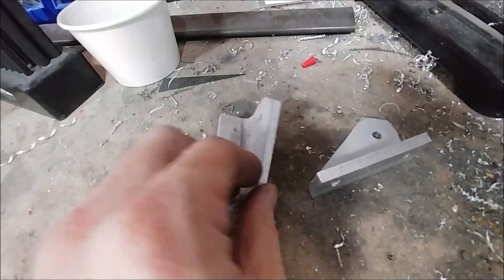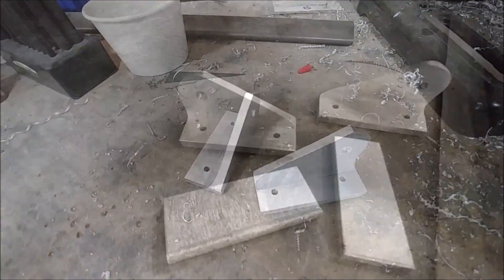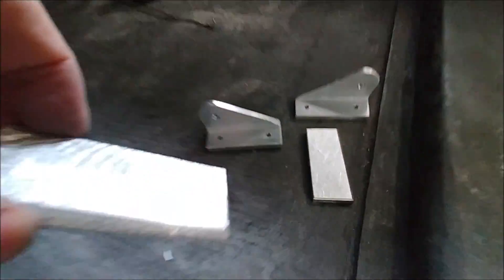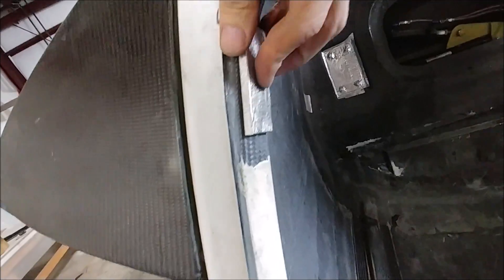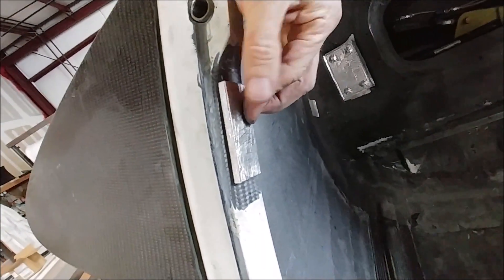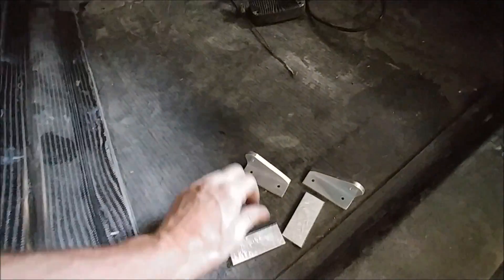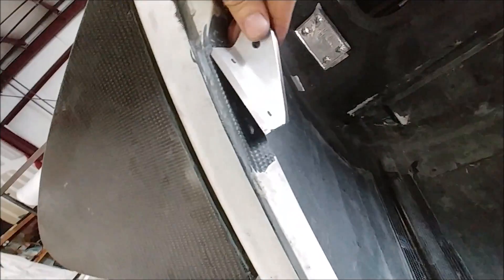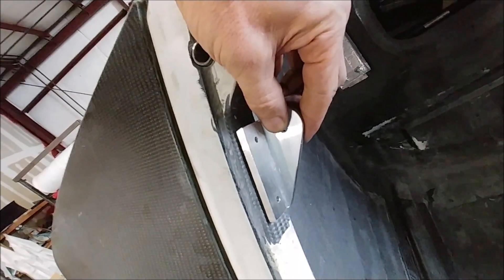While that was happening, I took the time to make the brackets and hard points that actually mount on the door frame of the fuselage for those gas struts. There are the hard points, all roughed up — that's pretty much where they're going to bond on the aft side of the frame. The brackets are done as well and they'll go off to powder coat at some point. They've also been tapped so they can accept the threaded end of the gas strut.